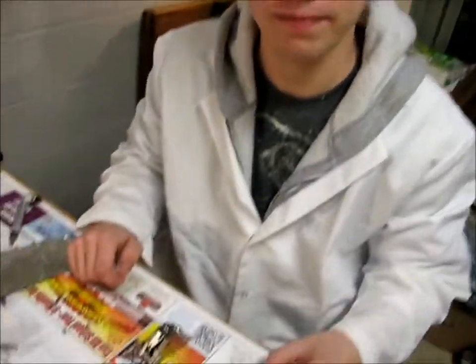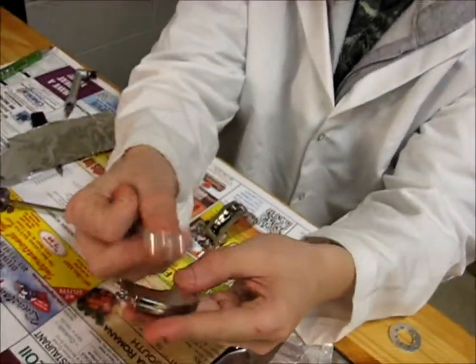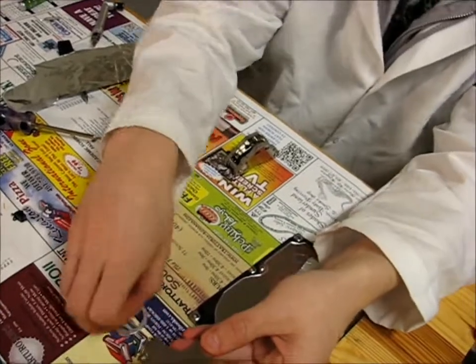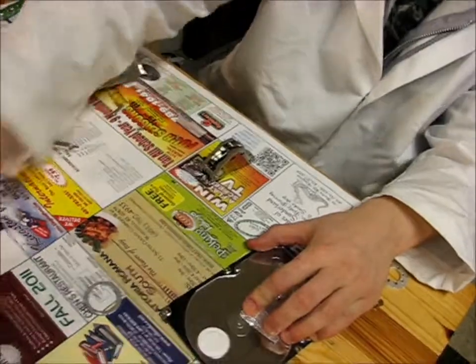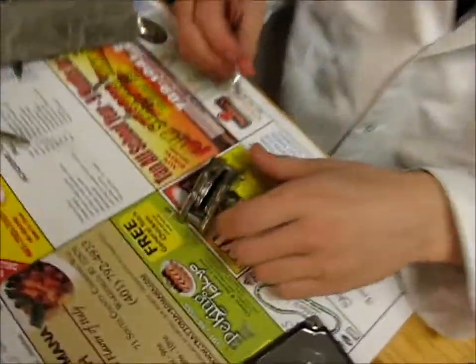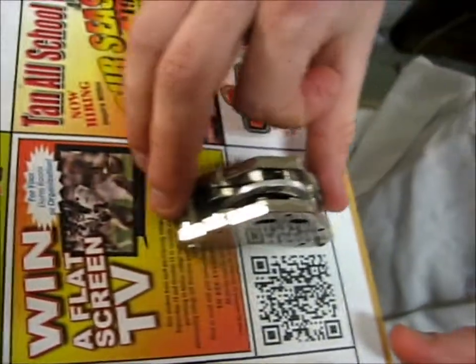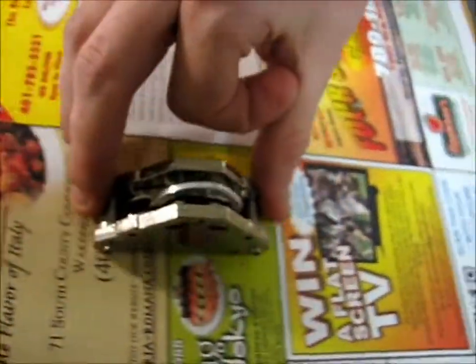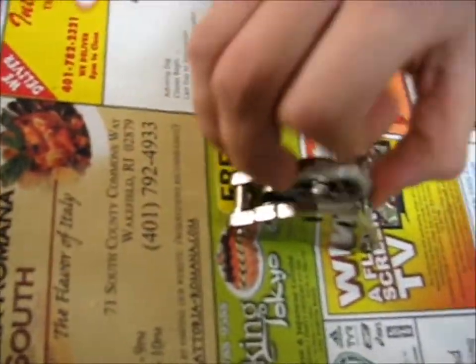Now I'm going to demonstrate a little circular motion. We have an aluminum ring salvaged from another hard drive — it's definitely aluminum, not magnetic like iron. We place it in our system, stick it right in the middle, then move the magnet around. You'll notice the aluminum ring follows along with it, trapped in the magnetic field. No matter how fast you move it, the ring stays with it — two separate objects moving together.